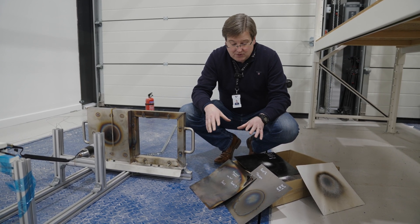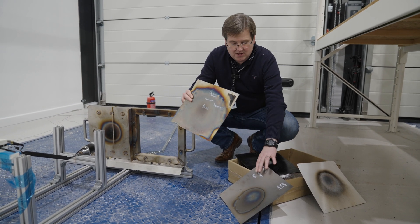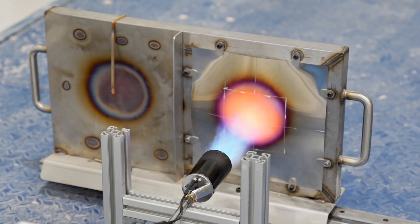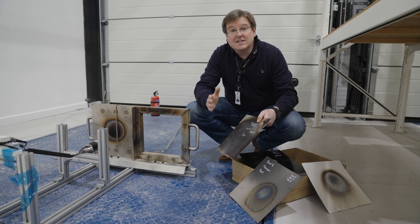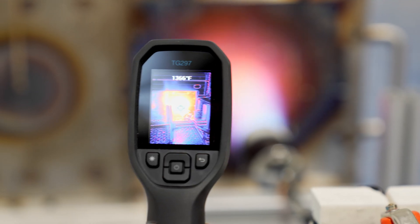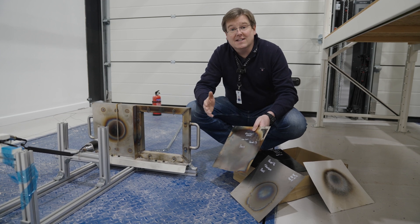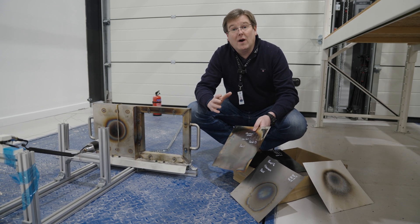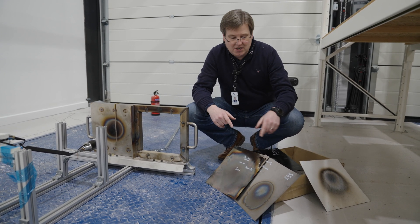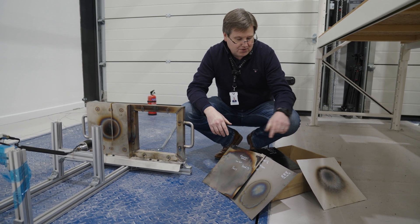The three main approaches are: first, to use either a conventional stainless steel or titanium firewall as you'd find in most traditional helicopters, and use that as an insulative barrier in a firebox. The downside is it's generally quite heavy, and in order to control production costs you're limited to very truncated shapes, which would make the firewall quite large and have an impact on the shape of the fuselage. We've done that as a control specimen.